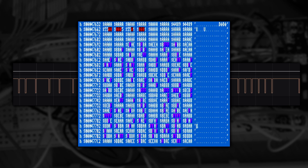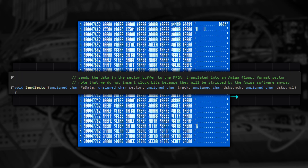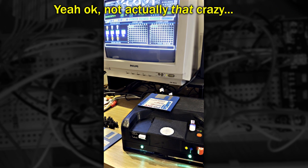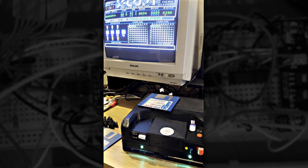This had to be coming from the ADF code somewhere. Taking a look at the code in the MiST domain, I understood why. The MFM spec requires clock bits to be inserted into the data; once read back they're not needed anymore. It turns out, because they're discarded, there hadn't been any point in generating them — until now. So I modified this code to generate the required clock bits. Now I was able to do some more crazy things: here I have an ADF mounted in drive DF0 and I'm copying it to two real drives configured as DF1 and DF2.